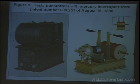That's an incredible statement about the amount of power that can go through this. Normal tungsten contacts, you're limited to about 2 or 3 amps maximum going through them before they start to heat up or fuse together. Here he was using mercury and running 20 to 25 amps from a 110 circuit. So it's a kilowatt of power just using a make and break.